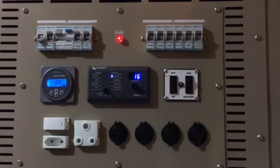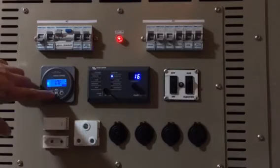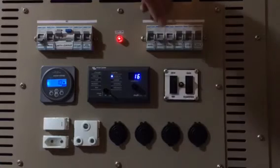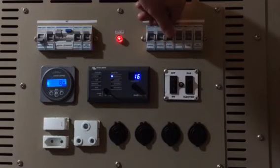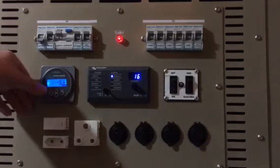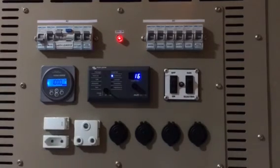My battery is at infinity. Just to show you the impact: if I switch off the fridge and the pump you can see the current increases, and because my battery is fully charged it will just keep the power coming to the battery at a trickle state. Activating the fridge, activating the pump — you can see the unit maintains. So effectively with this system in a semi-shade area I should have near infinity power as long as the sun is up.